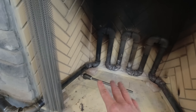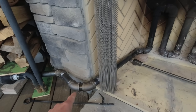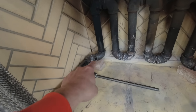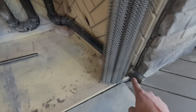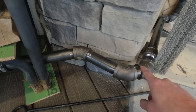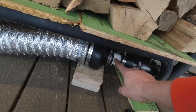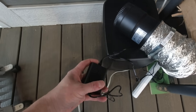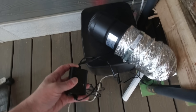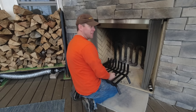So how is this thing built? One and a half inch black gas pipe. It's important you use regular black gas pipe and not galvanized, because galvanized throws off some toxic fumes. I got a bunch of parts and pieces — I think that's an 18 inch run. I've got 45s, a number of nipples, 12 inch pieces that rise and fall with close nipples and 90s. The back of that thing is about 24 to 26 inches wide. There's another 45 on there and it pumps out on the side. On the intake side, I use a Fernco coupler into some schedule 40 pipe into another Fernco that steps up to four inch into flexible ductwork, with a four inch inline fan on a rheostat. The most difficult part was figuring out the dimensions and all the pieces and parts to make it fully use the space.